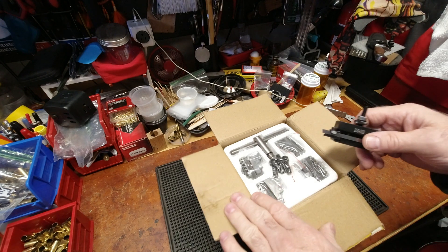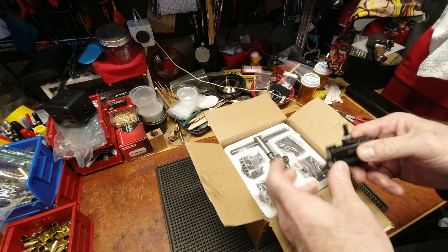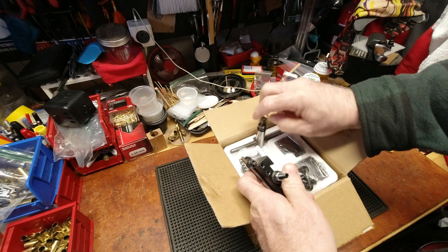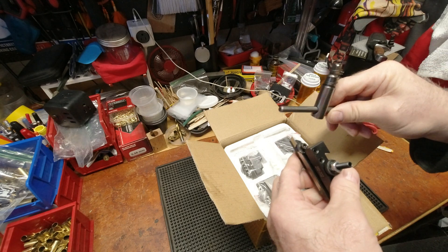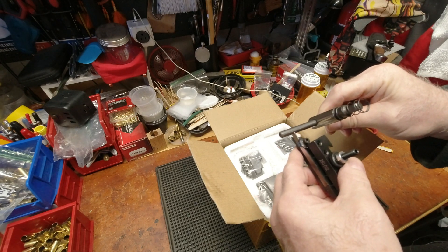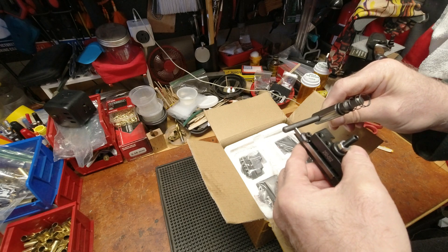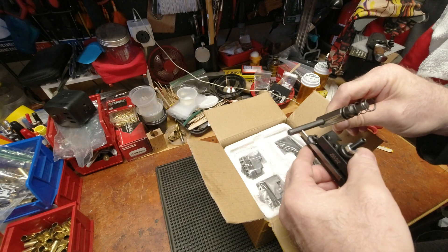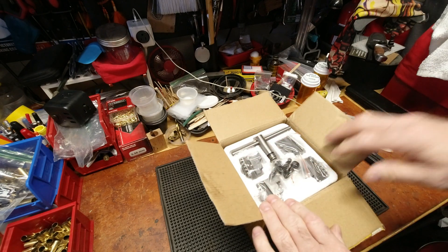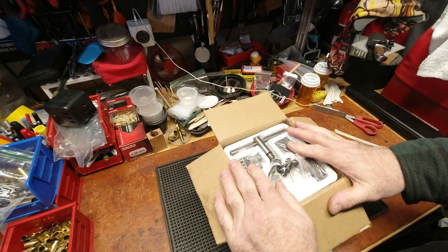I read about this, I saw it, and obviously as I'm learning I experienced it — which is one of the reasons this looks the way it does. As my material was turning and I was at relatively low speed with cutting oil, it was clamped in what I thought was sufficiently. The cutter went under just because of the force and movement as I was slowly progressing the parting tool forward — it went under and jammed up the piece of material I was cutting.